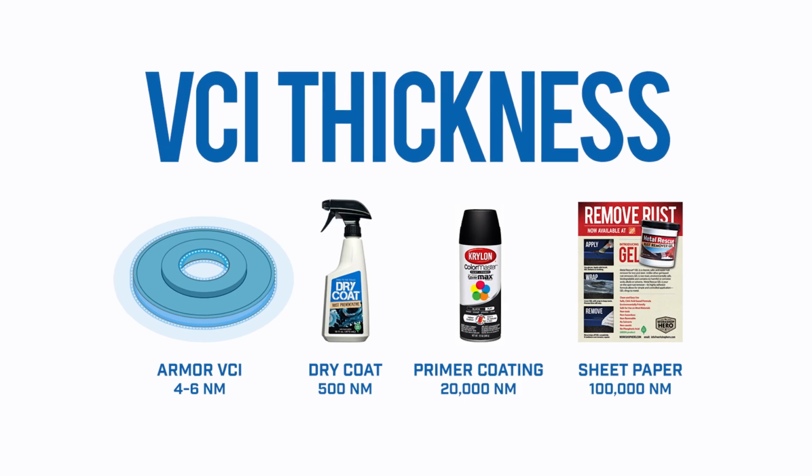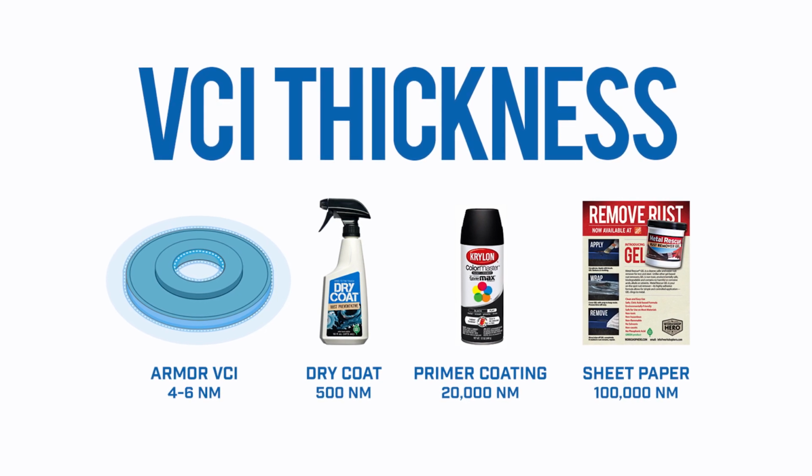Yes. But that being said, VCI is a nanotechnology. It is about 4 to 6 nanometers thin. And to put that into perspective, I didn't mean to cut you off, but I get excited about this kind of stuff. Go for it. A sheet of paper is 100,000 nanometers thick. That's crazy. It is. So that means when the VCI is emitting from the packaging material onto your metal part to form that hydrophobic layer that you were talking about, it is incredibly thin.